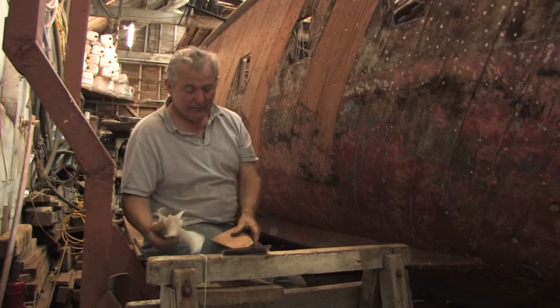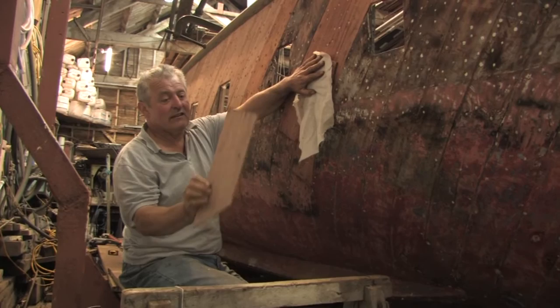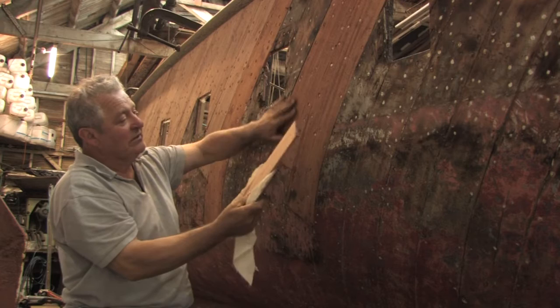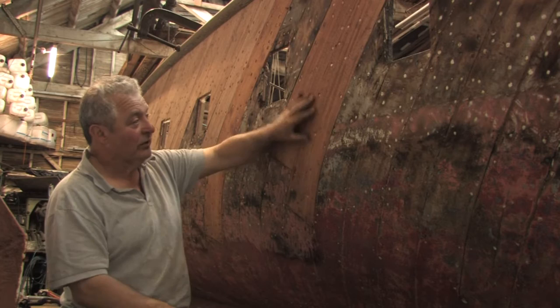this is calico. So there'd be a thin layer of calico goes between the planks, and then we have a slightly thicker plank, which was nearly 10 mm, and that goes across there. So when we get a join on here, there's four copper rivets go in there. So every joint, every place has a nail. There is a lead paste goes in between, behind the calico. So when that has the rivets in over that big area, they all tighten up and make it watertight.